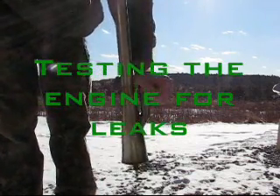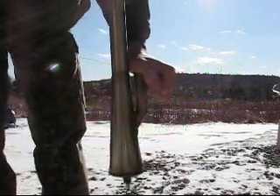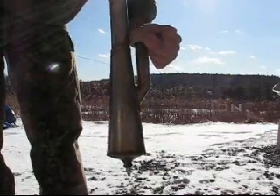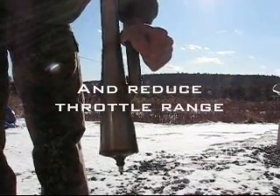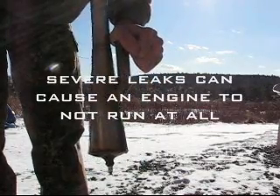This is the Focused Wave Valveless Pulse Jet Engine — you should be able to see it here. It's all TIG welded, stainless steel, 20 gauge, so you can run it statically without any problem for a long period of time.